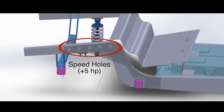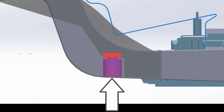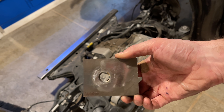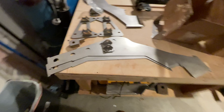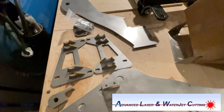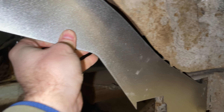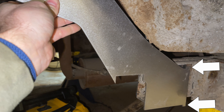These holes are kind of just there for extra welding if I have a hard time getting a good weld on the edge. The subframe actually bolts to some steel blocks that are going to be welded into these pockets — the bolts will come in through the bottom and thread into these blocks. I probably could have used some thick wall rectangular tubing instead of solid steel blocks, but whatever, it's fine. I sent a quote out to three water jet places. Advanced Laser and Water Jet came back with the lowest quote, which was great because I've worked with them before and I know they're good. A few days later I had my parts and I was ready to weld. First, I had to cut away the parts of the frame that were in the way — I used my water jet metal as a template, leaving little tabs on the top and bottom in the front and rear to locate the metal onto the frame.